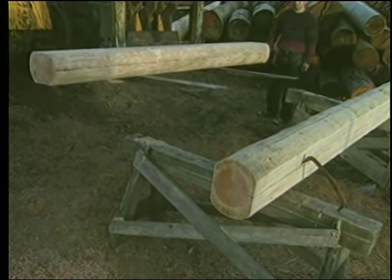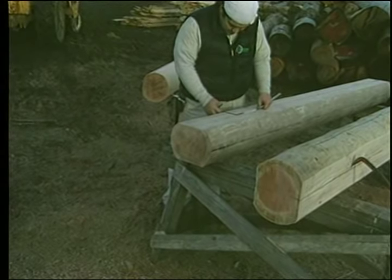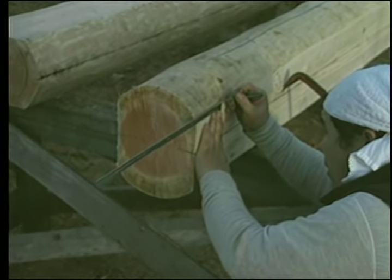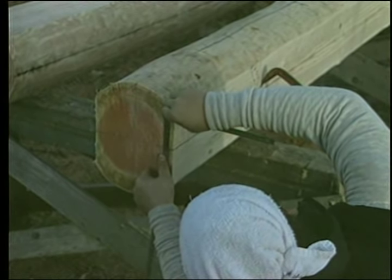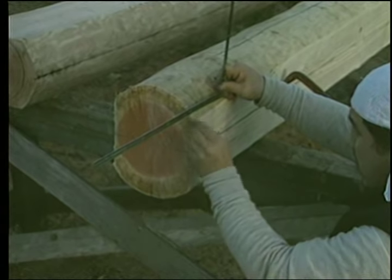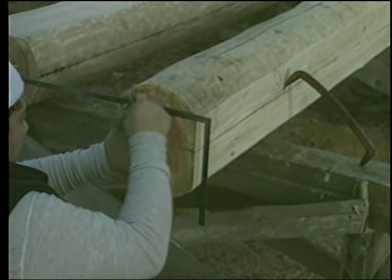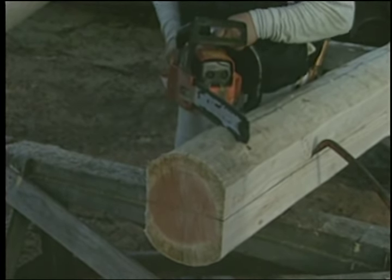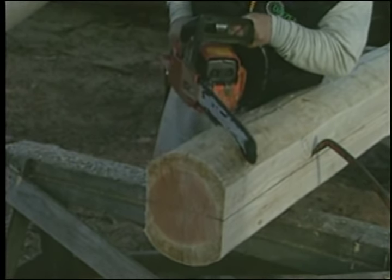You will now need to know the width of the flat on the top end of the king post, because we are going to make a neat fit at each join. Transfer this width onto the flat sides of the principal and make a preliminary cut. This cut should only be close to the line.